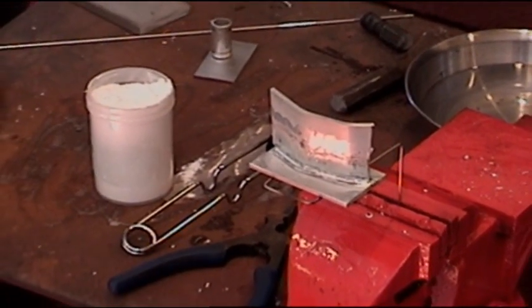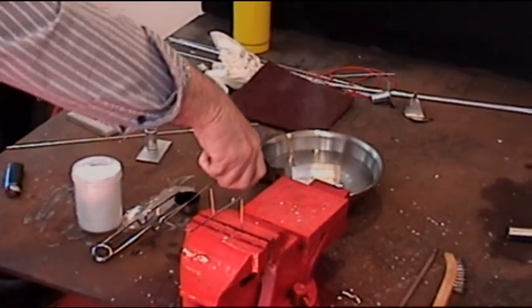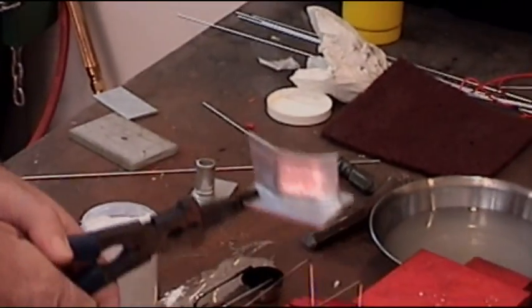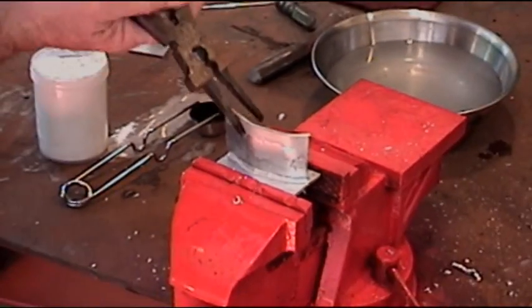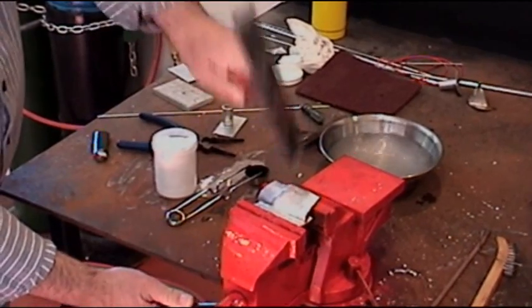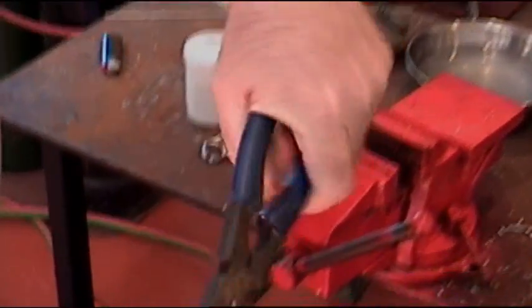What's happened is the flux has cleaned the oxides and the alloy has actually gone all the way through — what we call a capillary reaction. See how nice that looks? It goes all the way through; it's on the other side. So we want to see: is this strong? Remember, this is 1/8 inch aluminum. I'll have to put a hammer to it. It will hold every time.